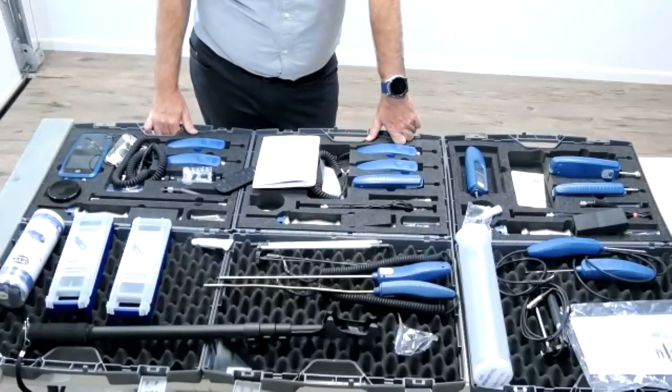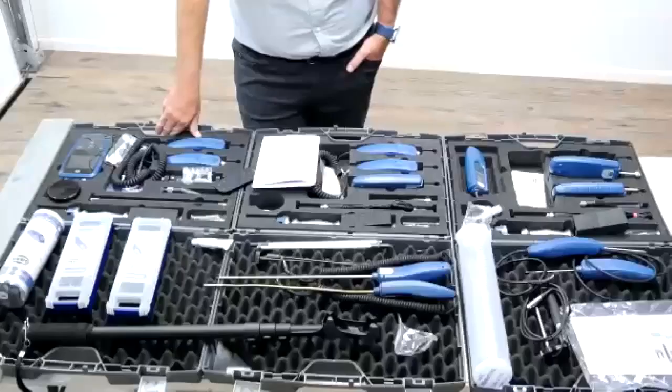Okay. So when it checks the screed, the cement screed and anhydrite screed, is it not going as deep when it checks this? It's a bit difficult to give an answer to this because it always depends on the actual recipe of the material, and there are several different recipes. A general rule might be that it will be able to get down about 3 to 4 centimeters with screeds. But it always depends on the actual conditions, so there's not really a general measuring depth that we can tell. But you will not stay at the surface. You will definitely go further down than this.